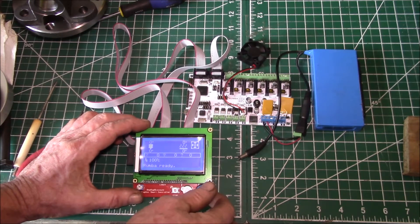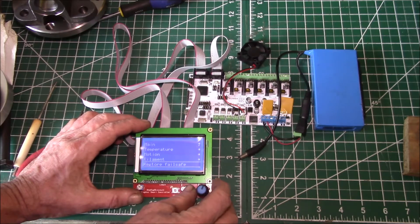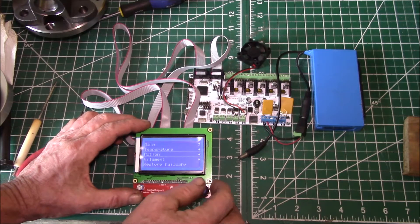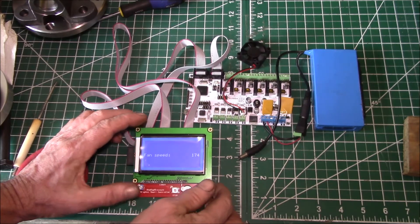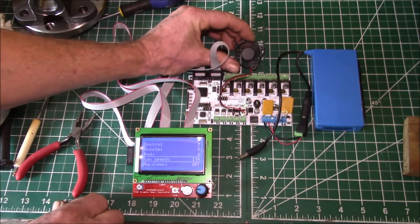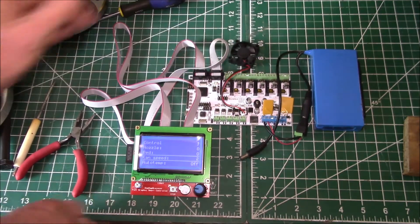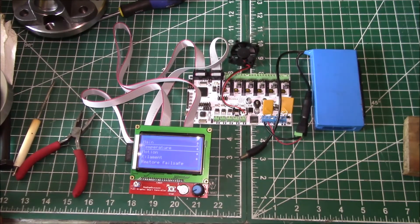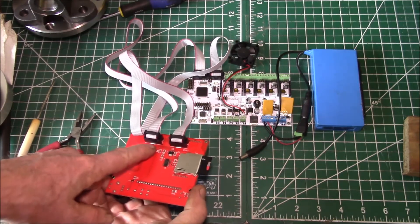The SD card is not responding — I must not have compiled that in. But you can see if I go clockwise the number doesn't increment; if I go counterclockwise it does. Here's my parts cooling fan — you can see the fan's running, I can turn it down to zero and it goes off.